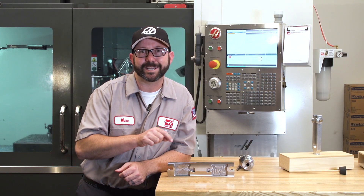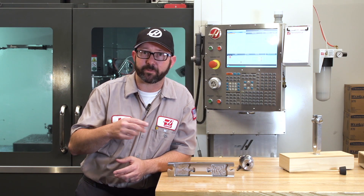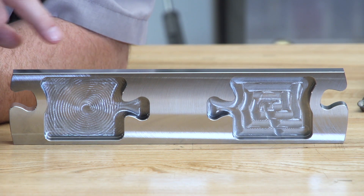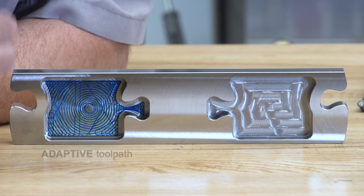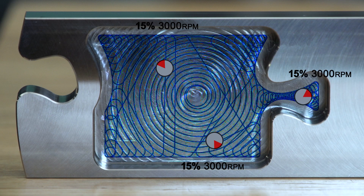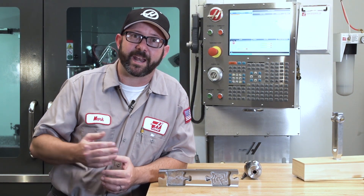This is the beauty of newer tool paths — adaptive tool paths, dynamic tool paths. There are tool paths like volume mill that base the path on chip size. What we're doing here is giving ourselves constant tool engagement, and this is a game changer that has changed the world of machining. Using an adaptive or dynamic tool path, our tool engagement is constant throughout the entire pocketing operation. I don't even care what that engagement is — 10%, 30% — what I care about is that the tool load isn't changing. Once I find the perfect RPM or the perfect feed rate, I can stick with it through the entire pocket. If I only had one bit of information to give you today, it would be this: find yourself a CAM system that has a modern high-speed machining tool path with constant engagement.